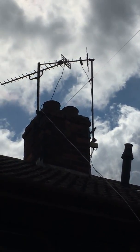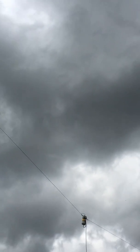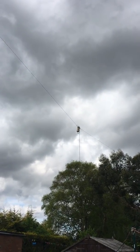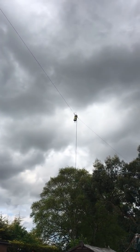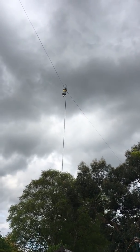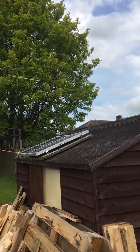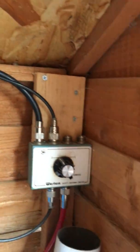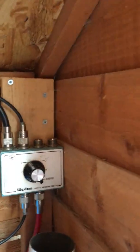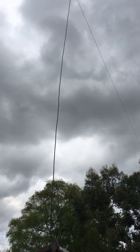Let's try and zoom in a little bit — yeah, just there, look — and it goes across. That's one third of the antenna to the balun there. Then I've got some RG58 coaxial cable — the slightly better quality braided RG58 — comes down into my shed where I've got a simple switch box.